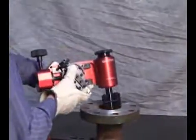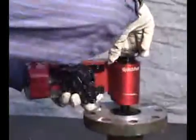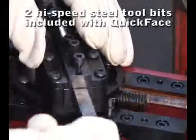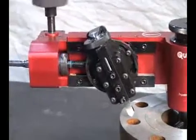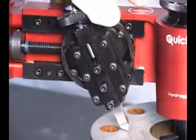After selecting the correct lead screw for operation, the tool body is inserted into the pipe bore, centering itself with adjustable locators. The tool can be adjusted with a calibrated slide to define cut depth and the correct finish. The tool arm is then rotated by hand, a worm gear mechanism providing a truly concentric, perfect spiral finish.